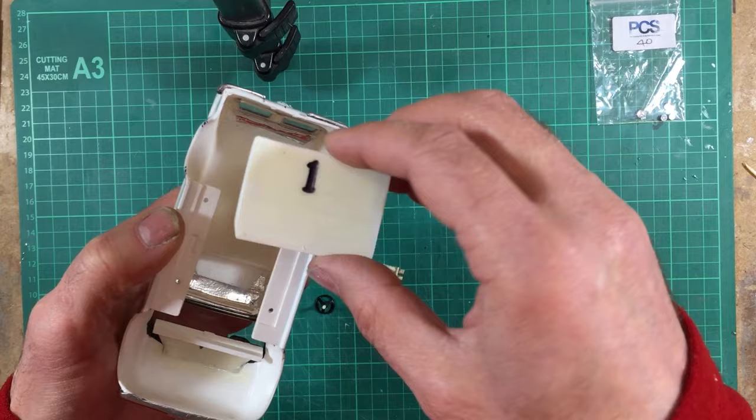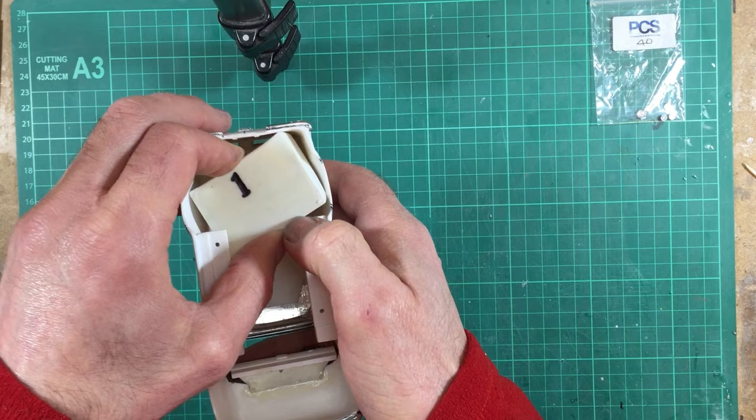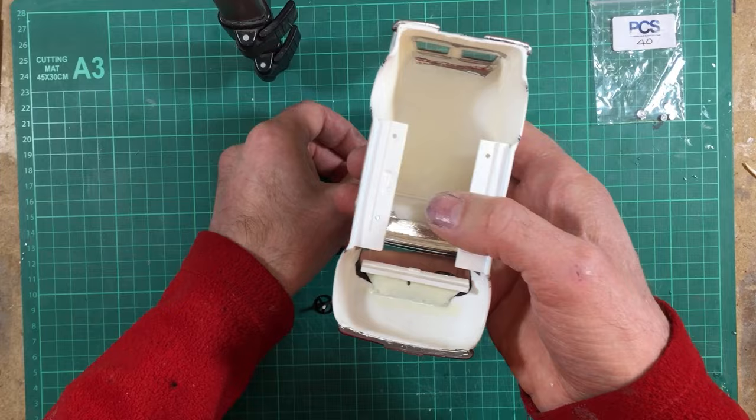and that is you put the interior in at this angle here, so it goes in like that, and then you can force this corner around that body mount and you can swing the interior around and back. You will need to spread the body ever so slightly, but it will go in. So if you do happen to fit the exhaust in first, then there is a way to do it.